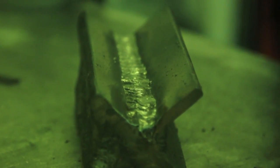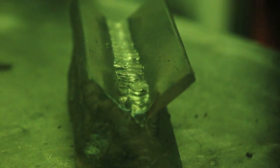This is perfect — exactly what we want. We went ahead and filled this in, there are no more slag inclusions, it's well fused to the side, and now it's equal with the rest of the weld so we can continue running one bead after another to fill this up. For the rest of this I'm going to speed things way up and show you how I finish off this weld on the cruciform — a little music and I'll catch up with you at the end.